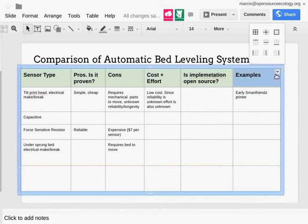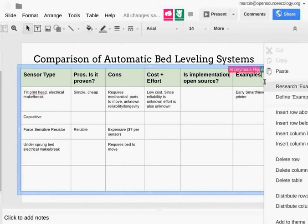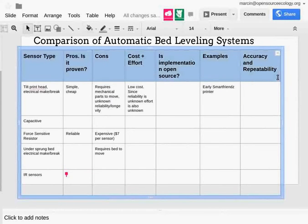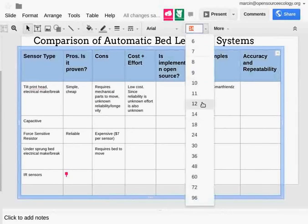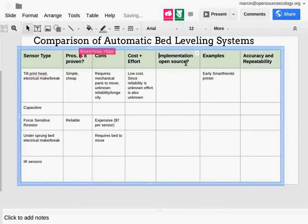Yeah, so I would say reliability. Would this be good? Like for example, 1/5 of layer thickness plus minus 50% of that layer thickness? Do they have figures of merit that anyone uses? I would say 1/5 the layer, that would be kind of what you definitely would need. Maybe it's even 1/10 the layer thickness. Well, we can ask Lulzbot what their algorithm is. What is their design for the accuracy imposed upon their bed leveling mechanism? Yeah, that would be our test driven design here.